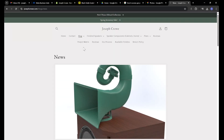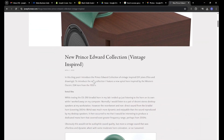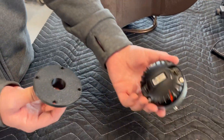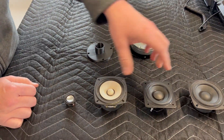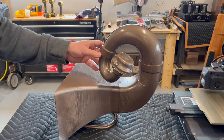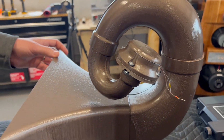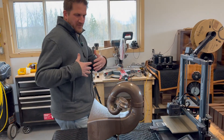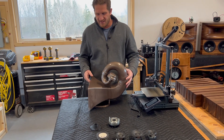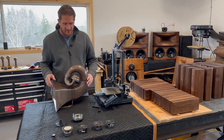If you look at my blog, I've tested various drivers — you can see here these are the drivers that I tested. It has an adapter for a 1-inch compression driver, and then you can also directly face-mount the driver into the horn. This is an 80-centimeter path length that loads down to around 165 hertz. It's a vintage mid-range focused sound where you're going to get the entire vocal range. There's going to be some treble output, but not a lot, depending on the drivers you've chosen.